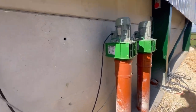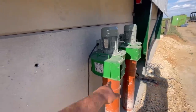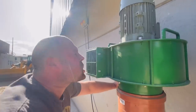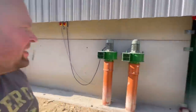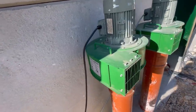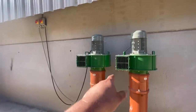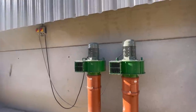These are the fans — Martin Lishman 2.2kW 3hp, made out of aluminium, and they are pretty powerful to be fair. Let's check they are working. There we have it. We'll test the temperature at the front and at the back and see how much these fans have brought it down. These are three-phase fans — always prefer three phase because they are a lot more efficient on electricity compared to single phase, and shift like three times the amount of air as a single-phase fan.